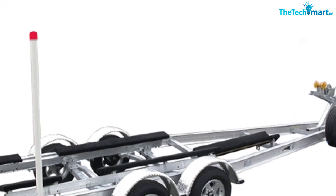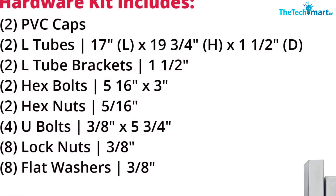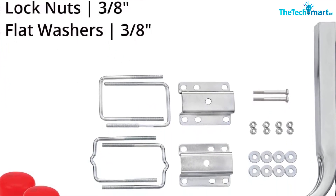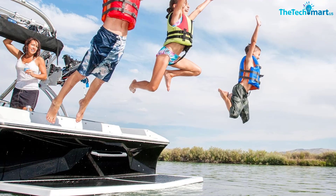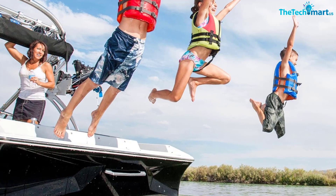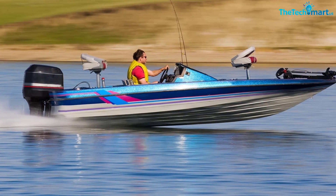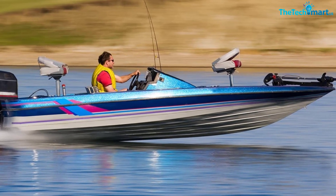The kit includes mounting hardware to affix the guide poles. The U-bolts are 5-1/4 inches, the steel supports are 1 to 1-1/2 inches wide, and the pipes are 2-1/2 inches in diameter. The poles are steel and the caps are red PVC for visibility. Installation is fairly fast overall — if you follow the directions, it shouldn't take much time. That said, watch out for the nut locks. Some reports suggest they are not super sturdy. The company seems to be mixing their metals — the brackets are steel but the U-bolts are galvanized. The nuts can get stripped easily and lose their nylon collars, so you may need to buy replacements. Go for galvanized nuts to keep everything the same.